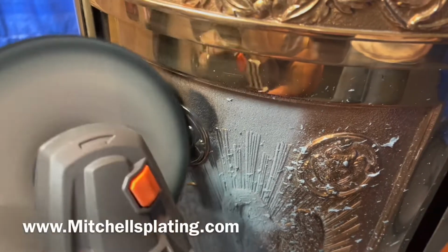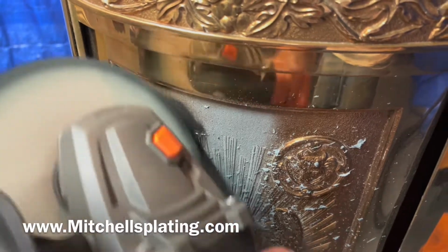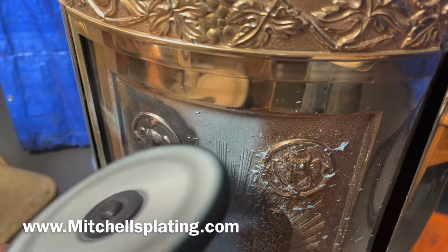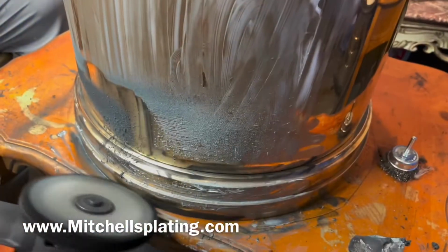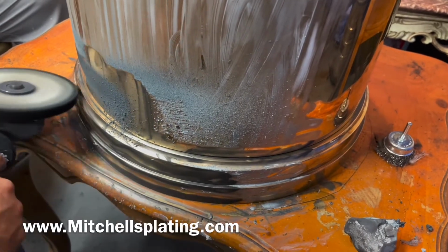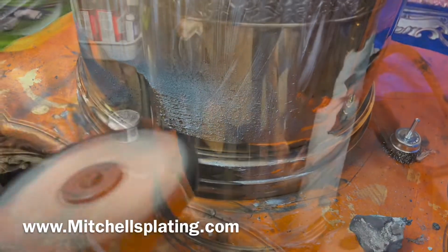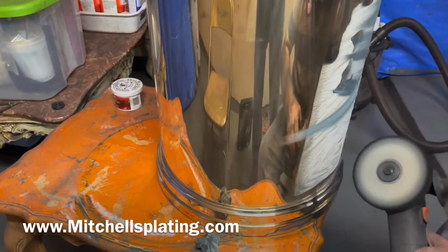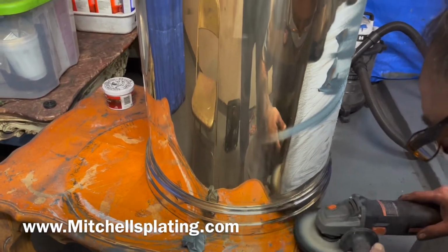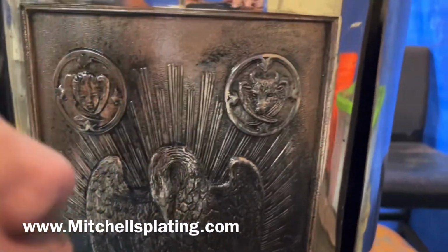Here we are resurfacing the metal, removing a layer of metal off the piece, and once that is done with our handheld motor, we start having the piece refinished all by hand to get it to a smooth mirror finish and then prepared for our gold plating. After we've restored the metal, we start cleaning the metal to get it to a clean finish before we are able to have the piece plated.